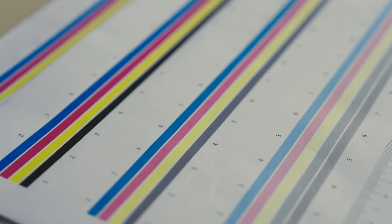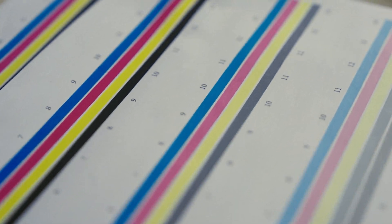Soon, I'll be profiling a new type of paper. First, I made sure the machine was working properly — it wasn't. Next, I perform linearization. Linearization is a calibration process where we print pure CMYK color grids with a specific optical density. Basically, it's about controlling ink coverage.